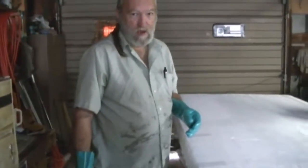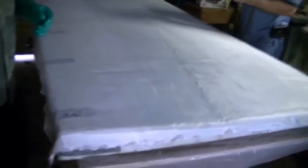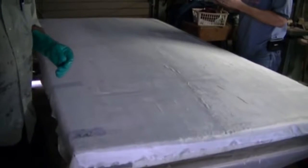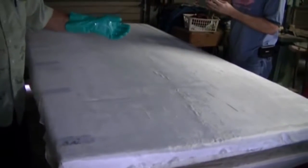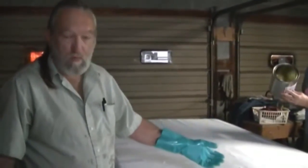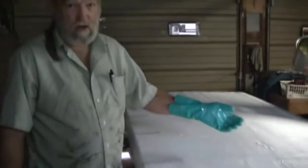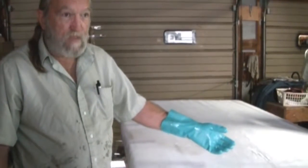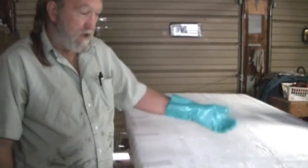If you see the consistency right now with this resin, it's getting pretty thin from being heated up. We've got the fiberglass cloth laid out best we can — this side is not a perfect job because we could not get the material spread out without a few wrinkles from the tackiness of the first layer. That was a mistake, but good enough, because when we get done the vinyl of the spa cover itself will cover all this up anyway. What I was looking for in doing this project is number one structural strength on these broken panels, and number two a solid vapor barrier so the EPS foam would not be absorbing water, getting heavy, collapsing, and busting up even further.